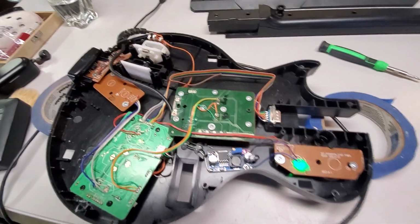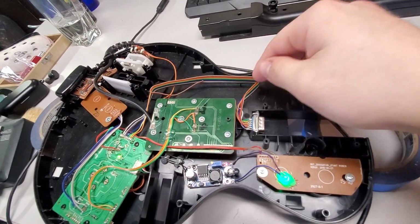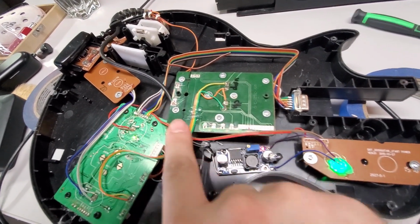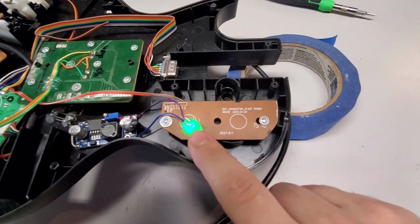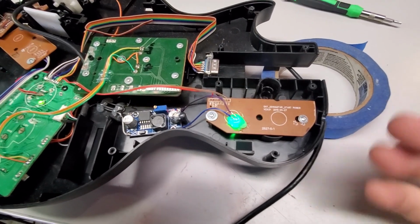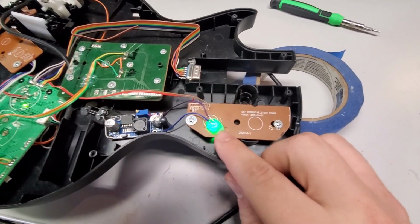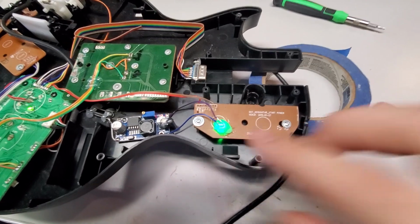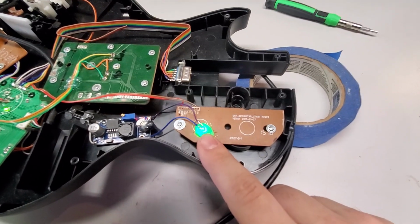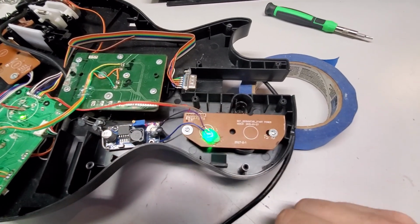And then here's the inside of this guy. Here we have the D sub connector that I probably made the wires a little too long, but I routed them around the strum bar. They go right to the board. I have the guide here that goes over to here, and then you'll see I have an LED through a DC voltage converter. It's really just there because all my LEDs are 3 volts, and on top of this board being 5 volts, I also like to dim them a little bit. They're pretty strong right off the bat, like just a solid 3 volts. So I'll turn this down to about 2.7, and I got these a long time ago for the wireless guitars since those are 3 volts. I picked up like 30 of these things for 15 whole bucks.